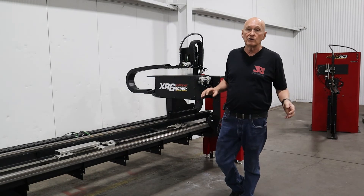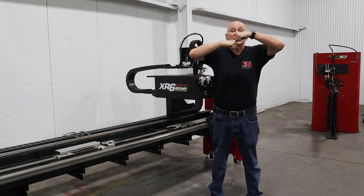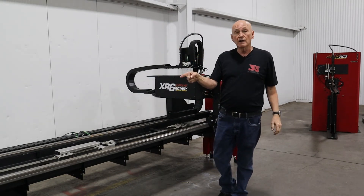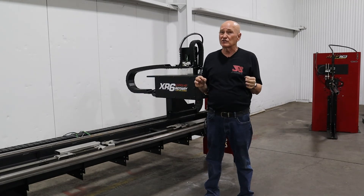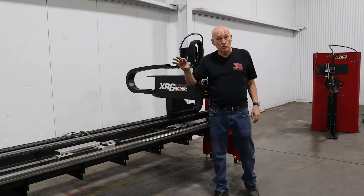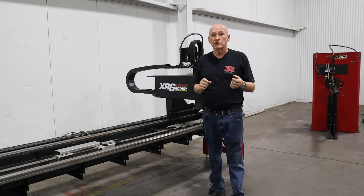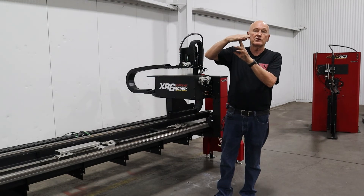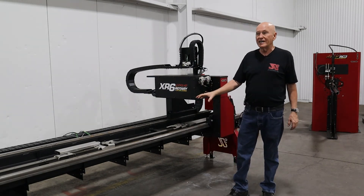The gap is only a couple tenths of a millimeter — six to eight thousandths of an inch — so you can fill it or not, it will not affect cut quality, even if you're doing routing work. The one thing you do want to make sure of is that the tops of the rods are even. Out of six joints, one of mine was misaligned vertically by about five or six thousandths of an inch. I just took a very thin sheet of paper, placed it underneath, tightened it down — worked out perfectly. Put a straight edge on it to confirm, and you're good.